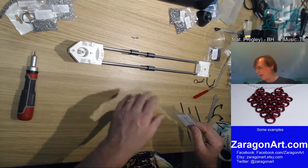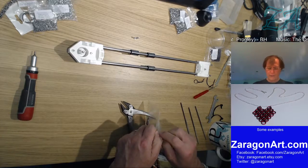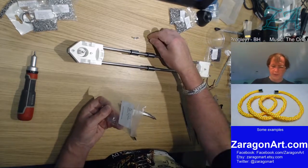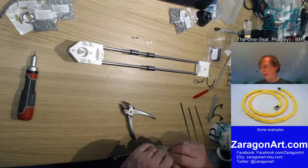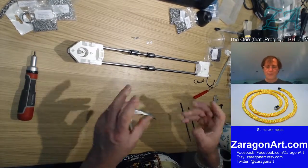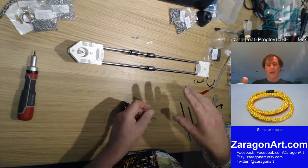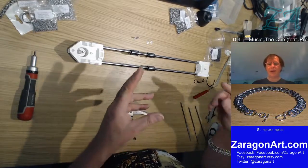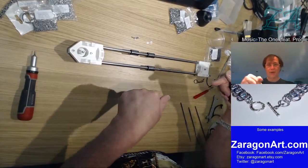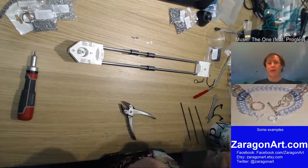What I almost did instead of building this was buy one of the Prusa i3 printers, and I suppose potentially I could do what he's done on there on this. One of the things that he has for that is a set of electronics and a print head on top. So I might just buy one to add on to it, we'll see. It takes four filaments, but it feeds them into one print head, so there's no aligning to do at all. It puts the filament in, takes it out, puts another one in, takes it out. So you can do four colours or four different materials. That's really interesting because there are no alignment issues with that at all.